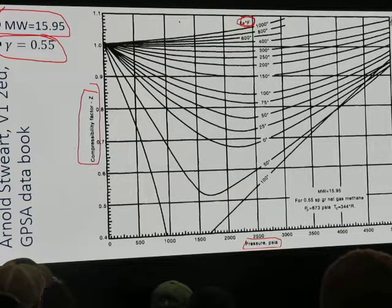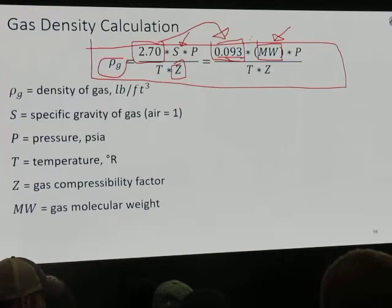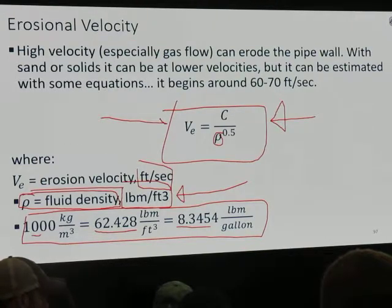No? It's going to be the temperature in the pipe. Then we calculate the erosion velocity, because we are a little bit away from the reservoir. We want erosion velocity in the line heater. So that better be the temperature and pressure at that condition that we calculate the erosional velocity. So it is in the coil of the line heater. How much is that for the pressure? Isn't it keep changing? The pressure keeps dropping, keeps dropping. The temperature keeps changing, sometimes it drops, sometimes it goes up. Which temperature are we going to use?